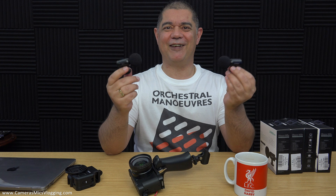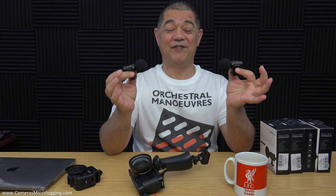You're going to be looking at that going, 'Dave, they look exactly the same as each other, what are you talking about?' What it is, I've got these little Sairen microphones which are absolutely fantastic for modifying. They're dead super simple. So what I'm going to do is take one of them and convert it into an omni. Basically when these come as standard these are super cardioid. So I'm going to swap out the capsules. This one here is actually an omni right now because I've actually done this bit already.